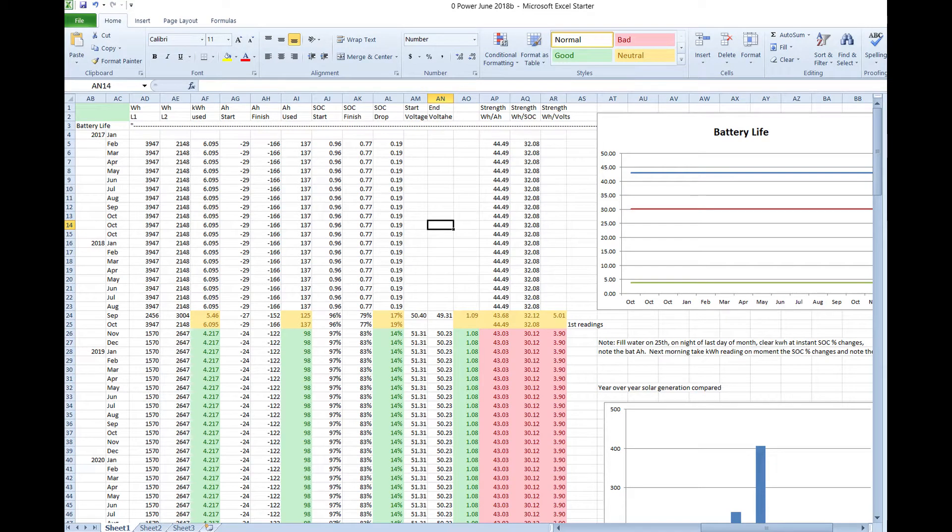I don't have any results yet because we're just getting started. But I'm hoping to plot out over time the watt hours out versus amp hours out, the watt hours out versus state of charge, and the watt hours out versus the voltage drop. I don't think amp hours is going to tell us anything because that's basically an identity. The state of charge maybe, but I'm not sure how Magnum calculates it. I think the best one is going to be the watt hours out versus the voltage drop of the batteries.